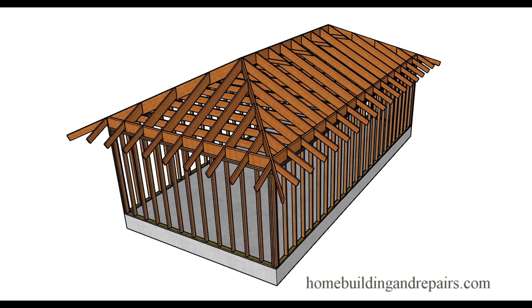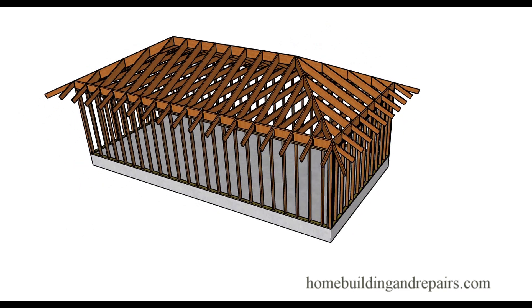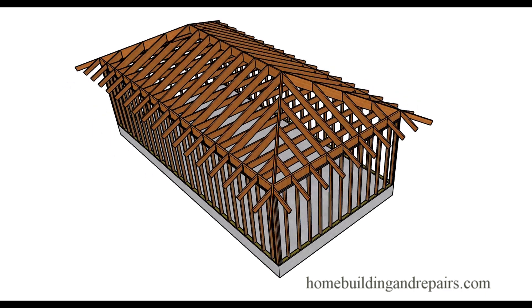Here's an excellent example of what a hip roof would look like conventionally framed — 2x12 hips, 2x12 ridge, 2x10 rafters with shaped rafter tails. These are actually cut to be 2x6 rafters instead of the 2x10; they have a little notch down here so that you can use 2x8 fascia board — common to do something like this to rip the tails down. The building is 32 foot by 16 foot, so 16 foot wide, 32 foot long, to give you an idea.